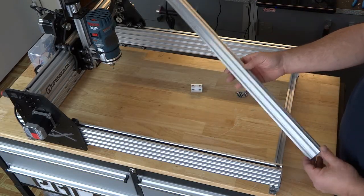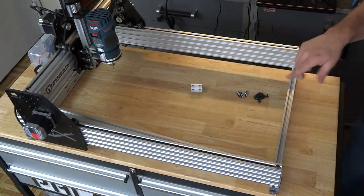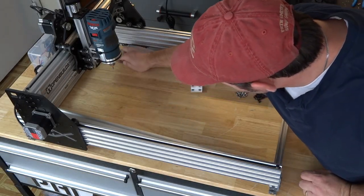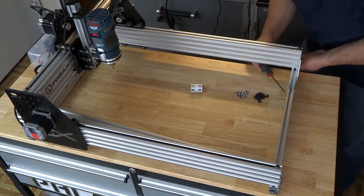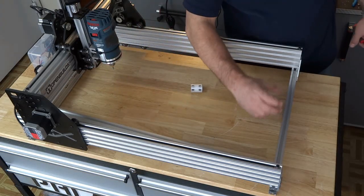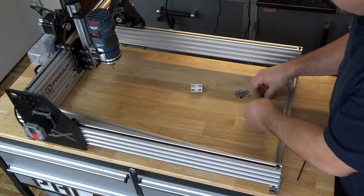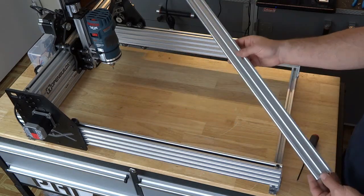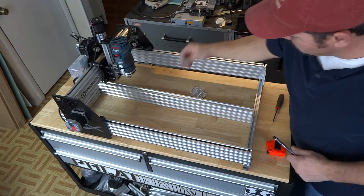We're going to take this out to the shop and cut a 20x80 the exact same size as this one. Another thing you can do is take the bottom row of T-nuts out but leave the top two in on the top row, because our triple brackets will be mounted in that top row and then onto the 20x80. I'll set the screws and hardware aside, go out to the shop, and cut the 20x80 at 710 millimeters. I've now got the four triple brackets ready.